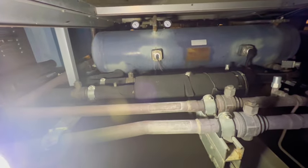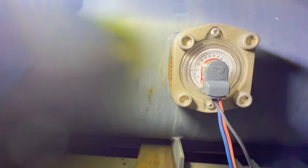So anyway, this is B-Rack right here. If I ain't mistaken, I had help. Actually, I've been here. If y'all remember, I had gotten Freon for my coworker, and apparently this rack had a leak on a discharge line. Let's pray that we got plenty of gas. Oh, yeah, we don't got no gas, y'all. Maybe that's the reason why they got that pallet down there. We don't got enough gas. Damn, that's gonna suck. Now I gotta probably leak check it.